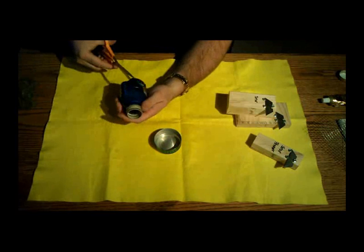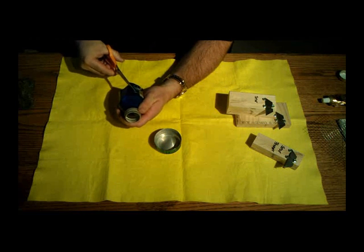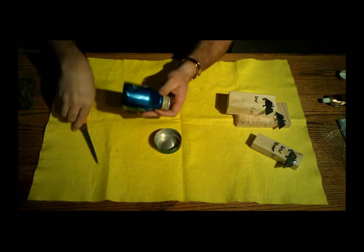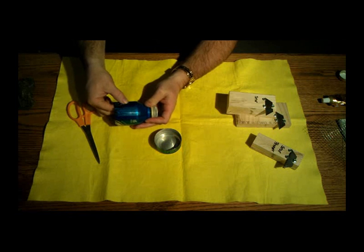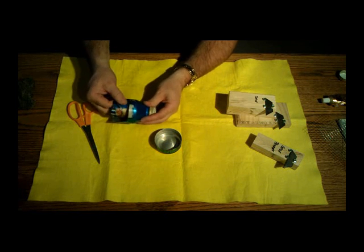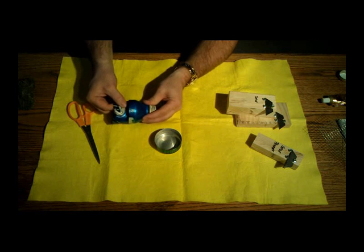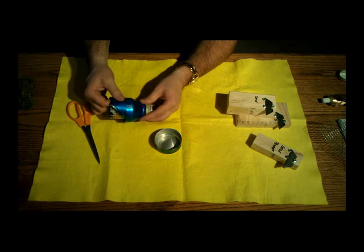And I'll do the same thing on the top here, except that, so I get up here, just nick that again, and instead of coming up, I'm going to try to get it to peel towards the inside. This sort of gets both edges going in the directions I want them to go, because this top lip needs to go inside of that bottom lip.